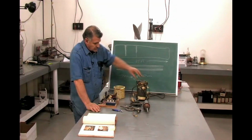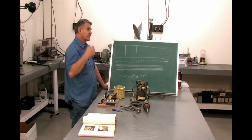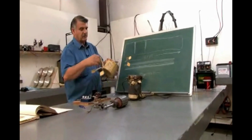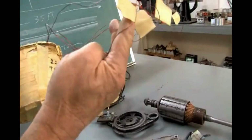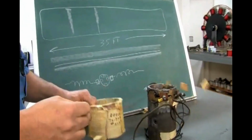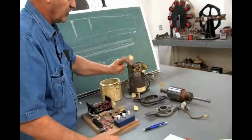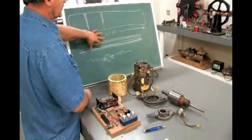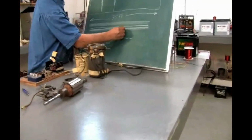And so we've got our condenser, and what we're doing is we're catching, when we gave this thing a pull, the generator, the motor switching. Actually, there's 3 windings here, see? So it's trifilar. So one of these was on the generator side, and one of these was on the motor side, and the other one is part of the circuit that helped charge this capacitor. And so this capacitor built a great big charge of between 3 and 400 volts.